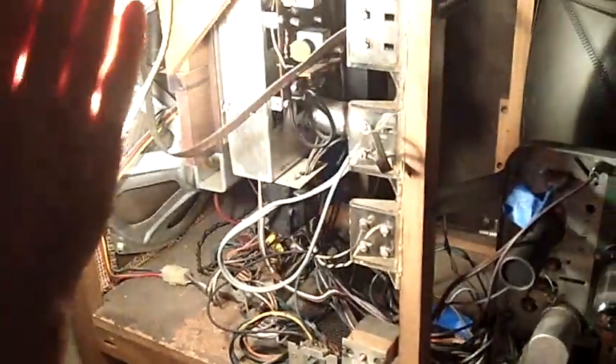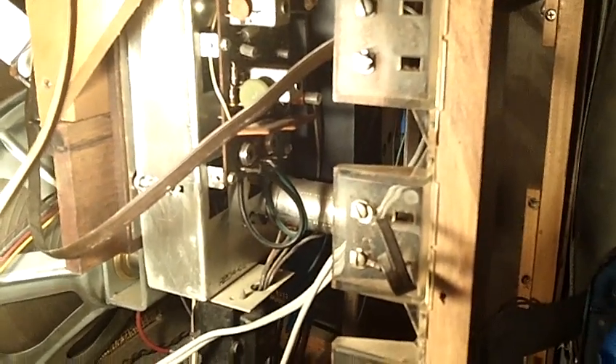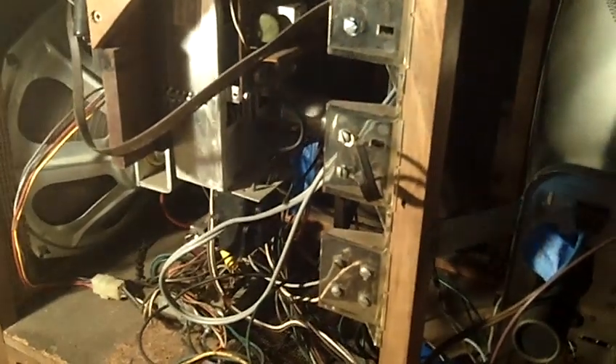We're going to move down a little bit more and I'm going to describe the amplifier. This uses a solid state AM FM stereo — solid state meaning no tubes, it uses transistors. I'm not usually a big fan of transistors, but for some reason these old Astrosonics I like. They've got big germanium power transistors and they work pretty well and have good sound. They don't have a lot of output — if you look at how small the power transformer is, that's pretty dinky. The audio output is going to be limited to the power in, and that little transformer is not going to produce a lot to drive these speakers, but it's a very efficient system. The AM FM stereo and phono preamp is in here.